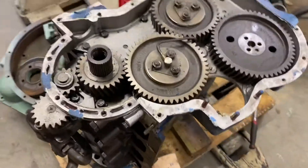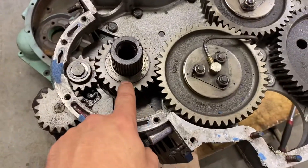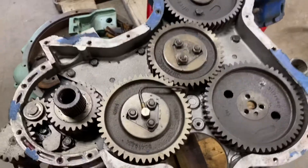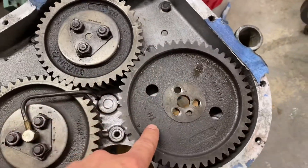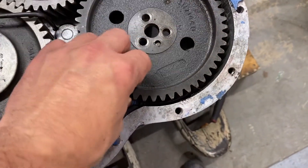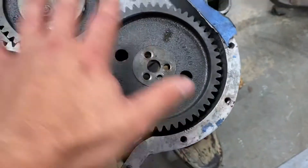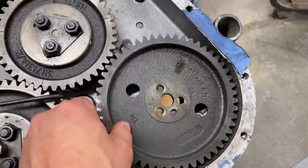I had wondered just about injection pump timing. So here's the crank gear. We have this idler here, another idler. And this would be the injection pump gear. Now the injection pump gear stays timed by being locked in place if this cover was on — it can't come out of the gear set there.